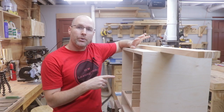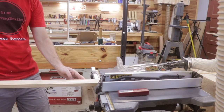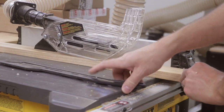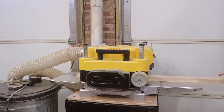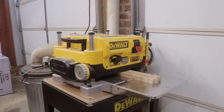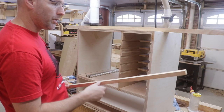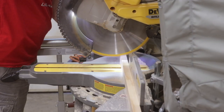The cabinet glue has been drying for the last few days. I just finished milling up some clear-grain pine to veneer the outside of the cabinet and cover up that end grain. These were scraps I had left over — I ran them through the table saw and cut them down to an inch in width at three-quarter inch thickness, then through the planer to smooth everything up. Now I'm going to cut these pieces to length on the miter saw, then glue and brad them to the face of the cabinet — it's going to look really nice.